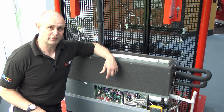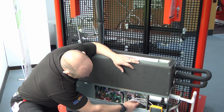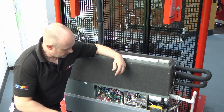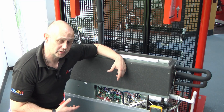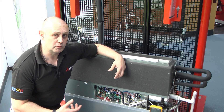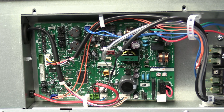Before doing any work on the cables, give them a little tug to make sure they're firmly in the terminals — check the AC side to make sure none are loose. Also check the M-net cable sizing, which needs to be at least 1.5mm screened cable. A smaller cable could give you resistance problems causing the communication fault. Also check over the PCB for any obvious signs of damage — burn marks or scorch marks.